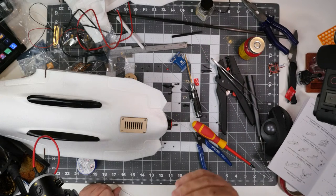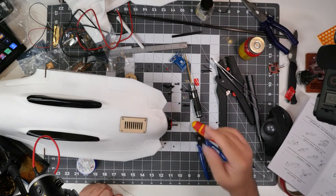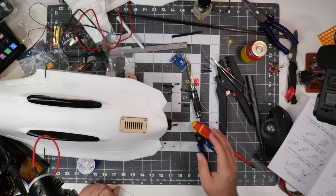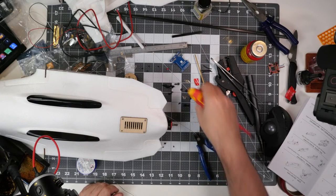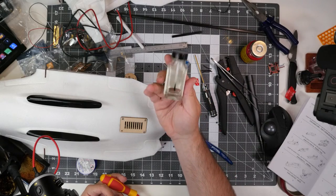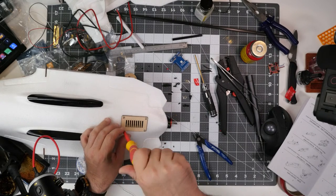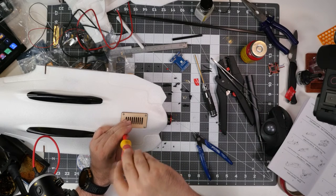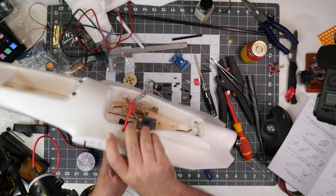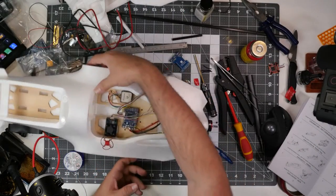That means that it's not really chemically connected to the surface it's protecting, so the water can get under this thing. However, conformal coating has much better adhesion to the surface and is actually waterproof. I'm not saying that you should waterproof everything and put conformal coating on everything. On the other hand, it's slightly less than half a bottle, and I have had this bottle for like 6 years. So it's a one-time investment, and you are good for years, and most probably this thing will just become useless because of age, not because I use too much of it. It's low cost, and just an extra measure.